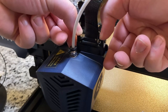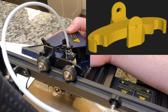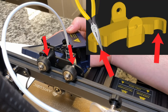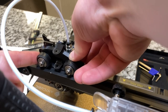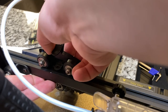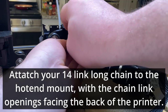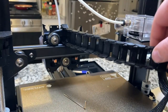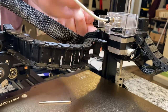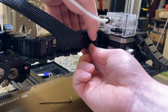Now onto the hotend mount. Start by removing the hotend cable from its housing. The hotend mount clips onto the wheel spacers, but I found mine was too tight to fit, so I stretched the slots out with some needle nose pliers. Push it onto the right spacer first, holding the y-axis bar up as you press down, then clip it onto the left spacer. Run the cable under and in front of the extruder motor, and put it through the chain connector on the platform chain mount so you can run the cable through the chain. Attach your chain link covers, but leave a few off on the end to allow the cable to flex as the extruder moves back and forth.